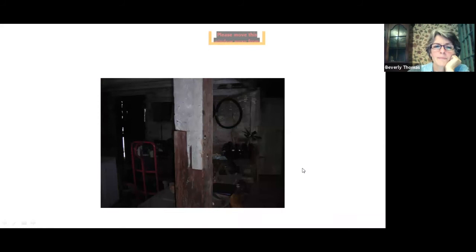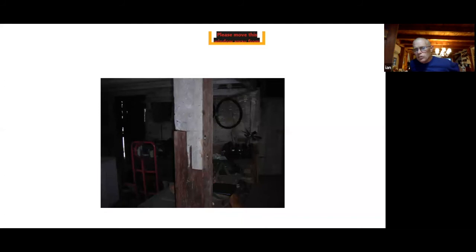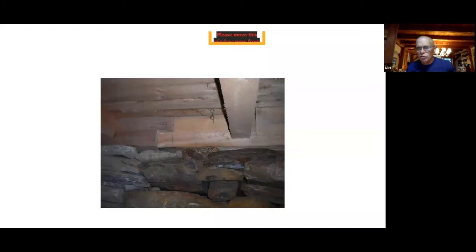That's an example of how not to do it — a regular straight lap joint with some lag bolts through it. When the barn starts moving, there's nothing fighting that movement in that lap joint. The bolts are there but nothing makes that bottom piece an integral part of the upper post besides the bolts. We want joinery that makes it like one piece of wood again. That's an example of a sill repair with the same kind of short straight lap joint — you can see the sill on the left is running uphill away from the other sill. You want a locking lap joint that will add integrity and keep the structural integrity of the timber frame.